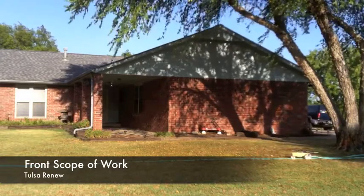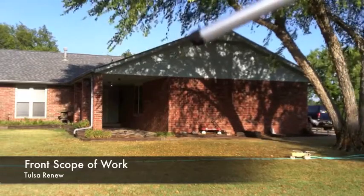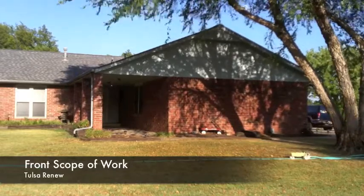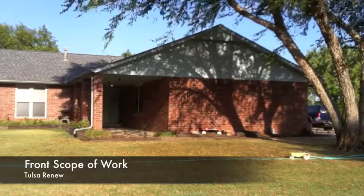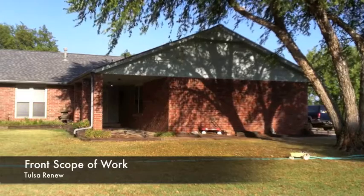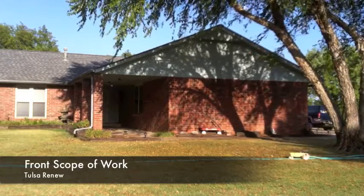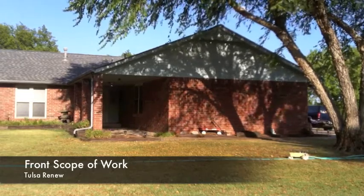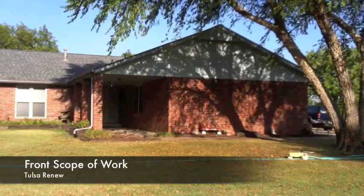And on the fascia overlay, we'll butt up right against the 1x2 that's covered by the metal drip edge and seal the fascia to the 1x2. That fascia material will be a 5/16 basically piece of siding that will overlay the fascia. And we install all the trim with a 16 gauge brad, so you barely see the nails. And all the siding will be installed with ring shank coil siding nails that are stainless steel, and you will not see any one of those heads. They'll all be behind the lap and blind nailed.